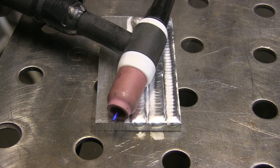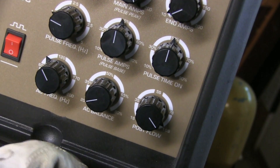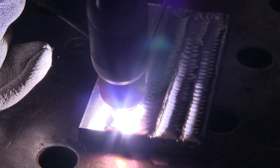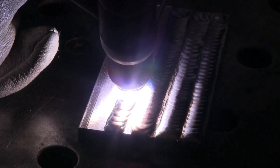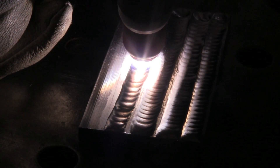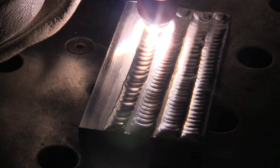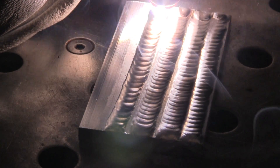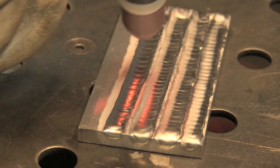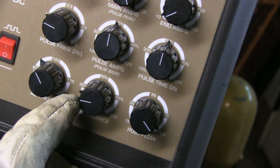The electrode is purple and blue — I don't have enough post flow. I'm going to increase that to about 10 seconds. I'm going to pretty much max the AC balance out to as little cleaning as possible, which is at about 20%. Some machines will take you all the way up to 99% — Miller Dynasty for instance. I never weld at 99% though, usually 75 or lower. Even with cleaning set as low as it goes there's a lot of cleaning, and part of that's because I'm using a number six gas lens — you typically get more cleaning action with a better gas envelope. That cleaning action does not like to go where there's no gas.